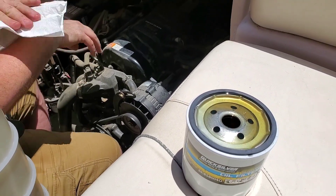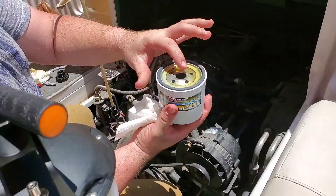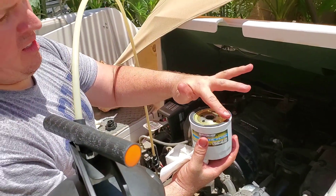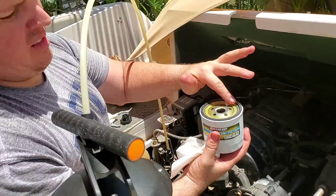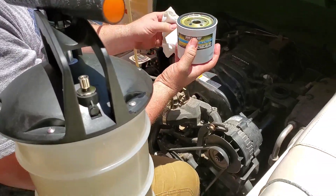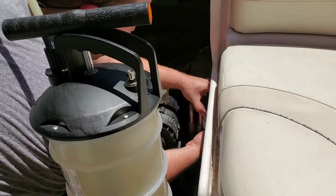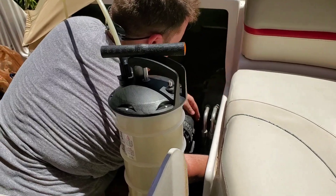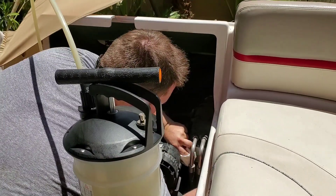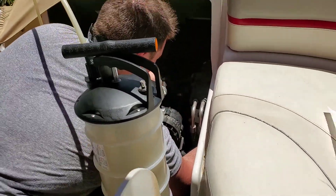She'll settle down and soak into the media. Alex is going to wet the rubber O-ring — take your fingers, hit all the rubber O-ring, get all around the sides. Look how delicate he is with one finger — beautiful. Now she's ready to thread on. If you spill a little bit, no big deal. We're going to thread her back up and torque her down to about 15 to 20 pounds — just hand tight.